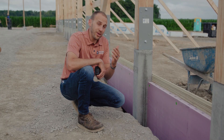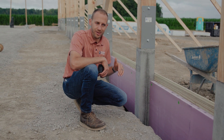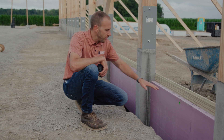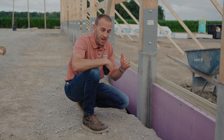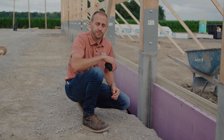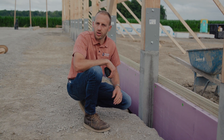So, what we like to recommend is that whenever you have to meet energy code, you're going to need to put a trench around the outside perimeter of your building. A lot of times energy code allows you to get by with a two-inch styrofoam that's 24 inches deep into the ground, or 24 inches below grade. Well, with post-frame, it's kind of like, well, I'm already digging my holes — how does that work?